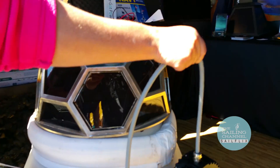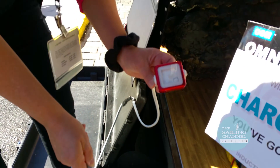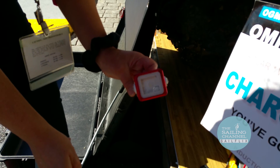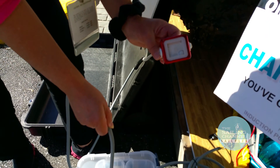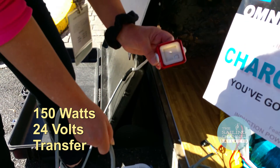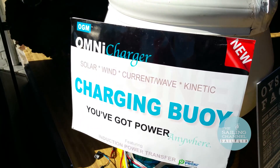The transmitter is actually going to be built into the buoy itself — you'll literally be able to drop it into the cavity of the buoy. And then, as I'll show you here with this light, as the receiver hits the transmitter, you start to transfer the power wirelessly from the battery bank at the ocean floor onto your battery bank on your boat. We're transferring 150 watts at 24 volts.